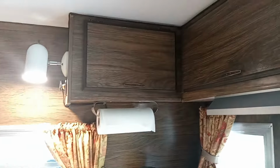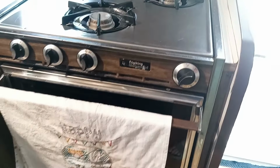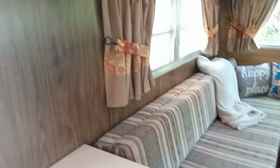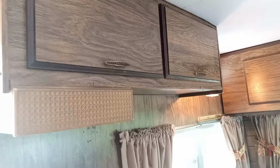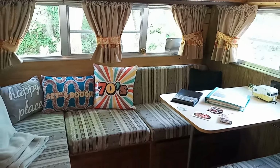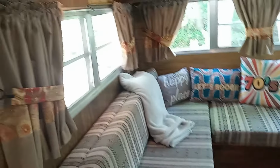Now, did you have to redo everything on the inside, too? Interestingly, no. We thought the interior was toast, and had even already bought paint, but we thought that was our only option. But as I was starting to restore everything, I started messing around with it and discovered that this is actually not printed paper veneer, but printed wood veneer. And I discovered that taking some Danish oil tinted with dark walnut stain, I basically just recoated the walls, and it brought the moisture back into the walls, and it actually hid all the scratches. Oh, so kind of like a scratch cover. We used to use Old English scratch cover. Yeah. Just completely covered it all.